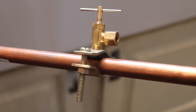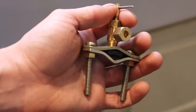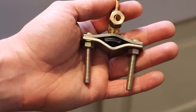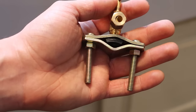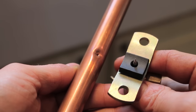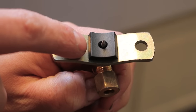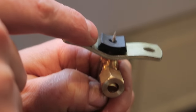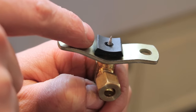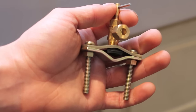In any case, don't ever use this type of valve. These are called saddle valves — they use a clamp-type system that clamps onto the pipe with two screws and uses a small needle to puncture it, giving water to whatever it's connected to. However, these have a tendency to leak from the rubber joint after a while and are an accident waiting to happen, so I suggest you stay away from them even if they're very tempting.